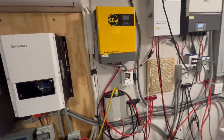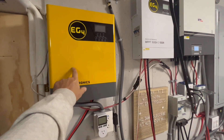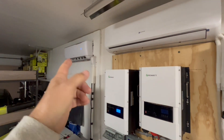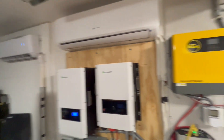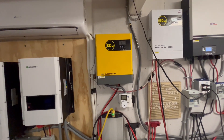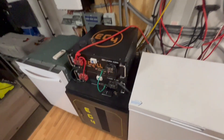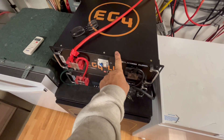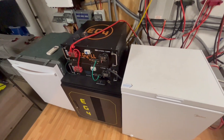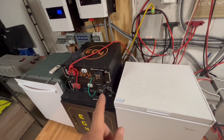When the sun comes up, we have some solar panels — little 100-watt Grape Solar panels, eight of them hooked up to this one — that we're testing to run that mini split. That's the same exact one as in the motorhome. We're testing this inverter and trying to get away with just 800 watts of solar panels, though we might need 10. We could also use two of these 5.1 kilowatt hour, 100 amp hour server rack batteries, and that would run that mini split with solar and batteries 24 hours a day.